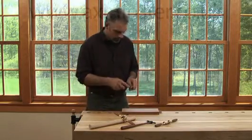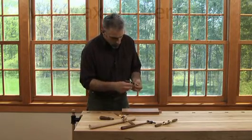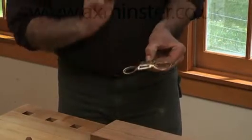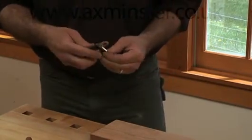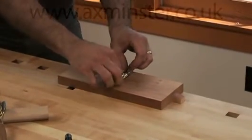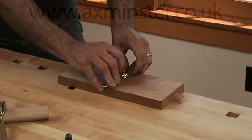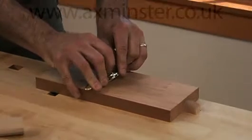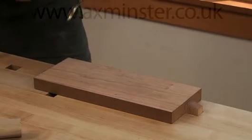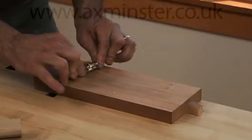When you have a curved bottom, it's a little bit different because you want to be careful that you're not referencing off the full open mouth. You want to reference off the front side of the mouth to get the actual depth of cut. So just same setup procedure, but rock the tool forward so it engages off the front of the mouth opening. Again, just dragging, when you feel that little bit of catch, tighten down the screw, and you should be getting the cut that you want.